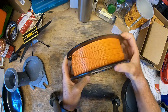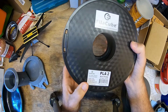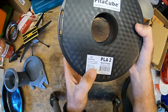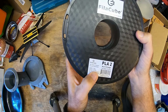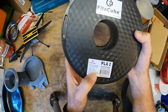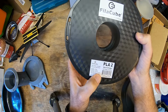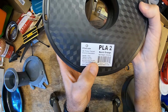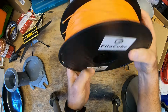I've been putting most of my filaments at 225, which is higher than one of these. This one actually goes up to 230, but even in some of the other filaments that say 220 max, it seems to work better with 225. Things flow better. The layer adhesion is good. I'm using 100% cooling now because it's not the winter time. And the bed temperature can go up to 40 to 50 degrees. I've been using mostly 40-degree bed temperature for everything too, so I'll be doing that.